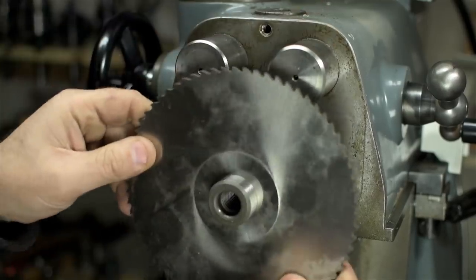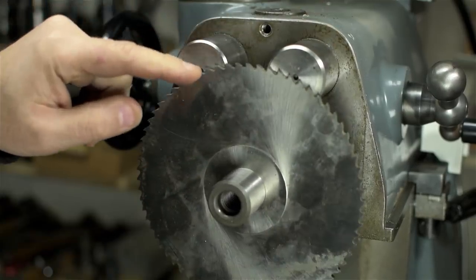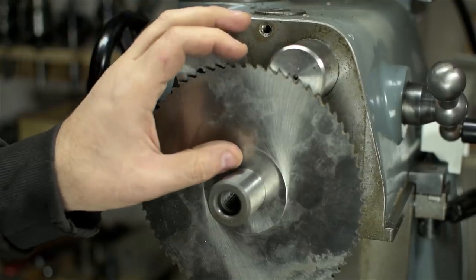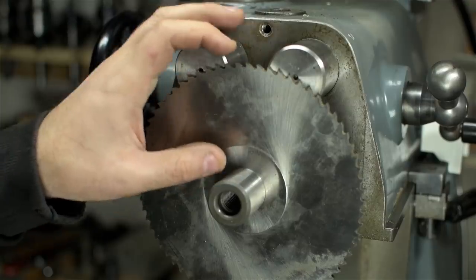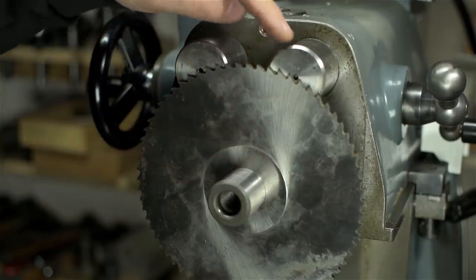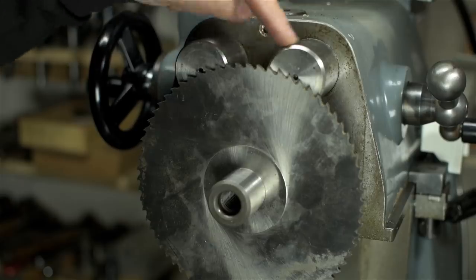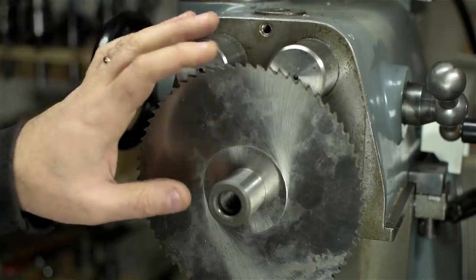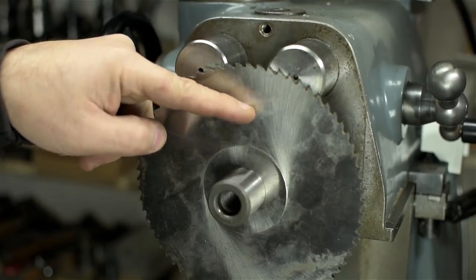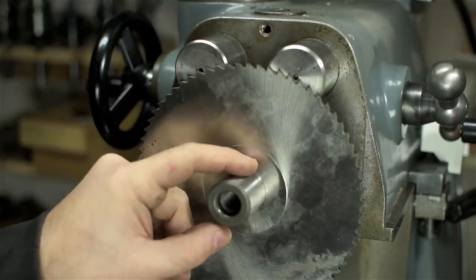They're just too big. Now I knew that, and in fact that's why I bought these saws, because as big as it looks, it really only has about a 2-inch depth of cut. The limitation I had with my other saws, once built up with the overarm support and enough clearance to get past these beams, these supports, although it gave me a very rigid setup, I wouldn't get very much depth of cut. Maybe 3/4 of an inch, an inch maybe, depending on what the pack looks like that holds the saw on.